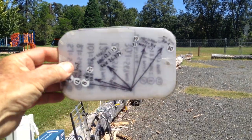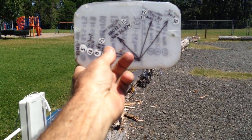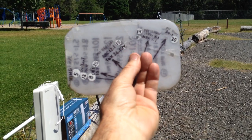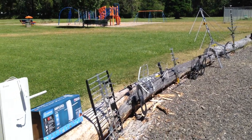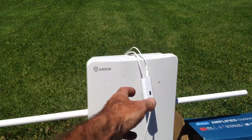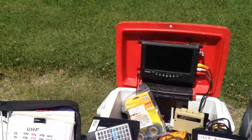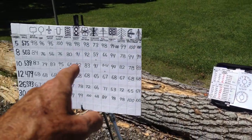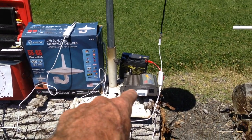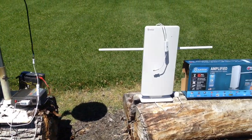In this area the signals are spread out in various directions, so usually when I'm putting up an antenna I want to point it somewhere in between to get the best of all channels. If one channel is particularly weak I might point in that direction. The downside I found with the Antop antenna is that flipping the switch on the amplifier didn't make any difference to signal strength. I'm using a digital-to-analog converter to measure signal strength here, and when I flipped the switch I saw no change. But when I unplugged the amplifier, most signals dropped out to almost nothing.